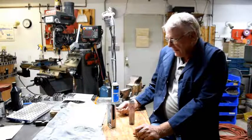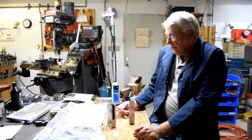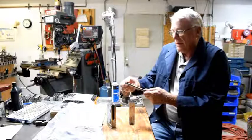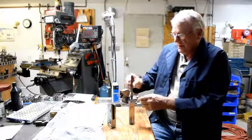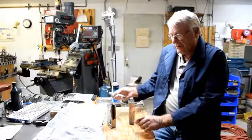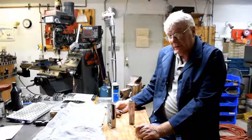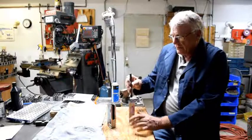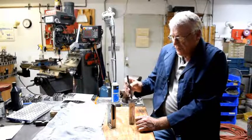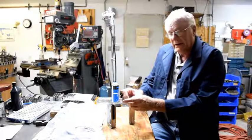So we got a hold of the manufacturer, in this case Helical. We got a new end mill, brand new, which we had turned down so it's reduced diameter behind the cutting shoulders so that we're not rubbing anywhere and this doesn't actually touch on the inside. We checked for proper speeds and feeds from Helical, then set the part up and started to cut the first one, and it shattered the tips on the end mill.